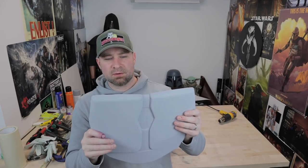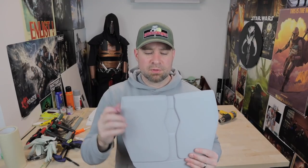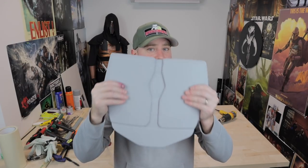Next up, what did I learn? Let me look through. When I was forming this, like I did the relief cuts, just make sure you don't go too deep and snap off your piece. It ended up working out okay. This is the one that I broke, and you can't really tell that I broke it. It glued on there. The super glue works really well for that type of gluing. And I prefer the PVC glue anywhere that you can clamp. All the way around, I recommend the PVC glue because that stuff works really well for PVC, and that's what this is.